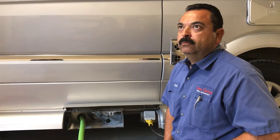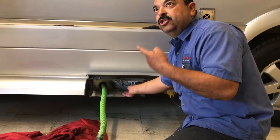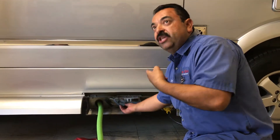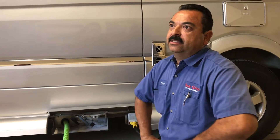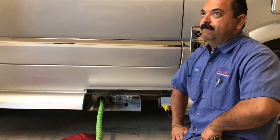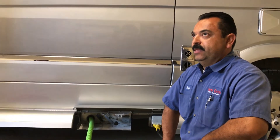So by pushing that back and forth it makes the blade spin in there? By pushing that in until you feel that the rod actually slipped in — at the end it's like a slot — then you twist it in whichever direction and that helps to assist, to move the blade in case something is binding it. Oh, that actually turns the macerator blade? Yes, the macerator blade. So you're turning the same blade — it's not a second blade. No, it's the same. You just assist it.